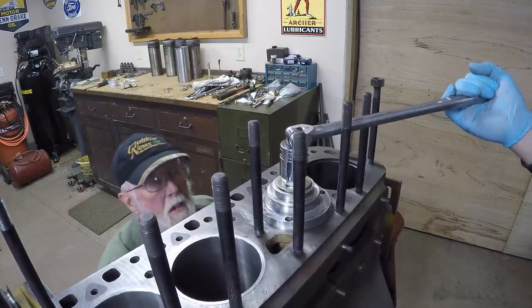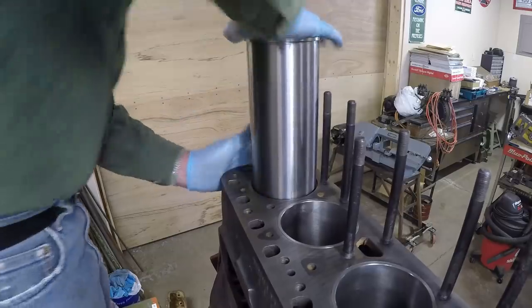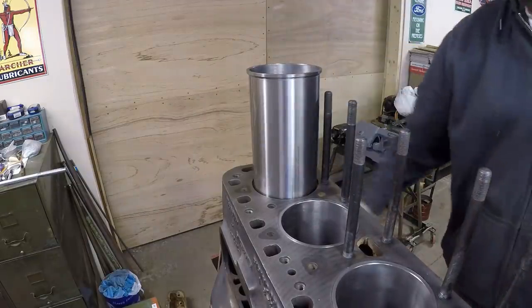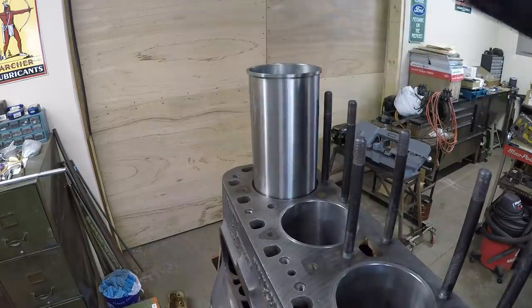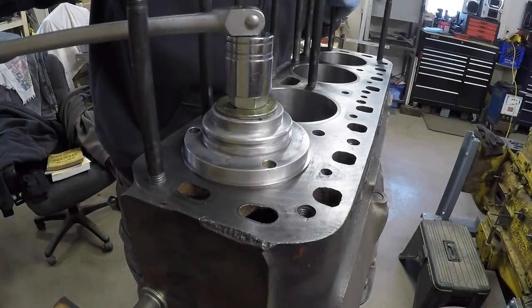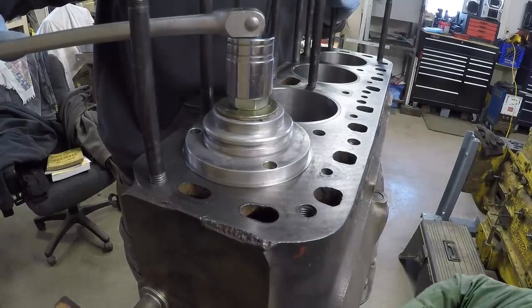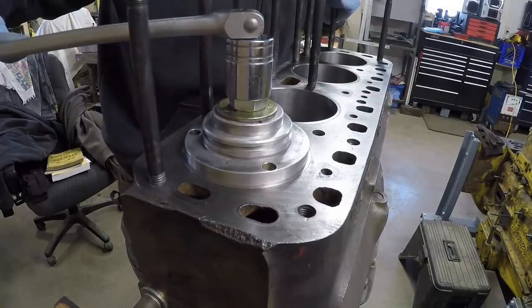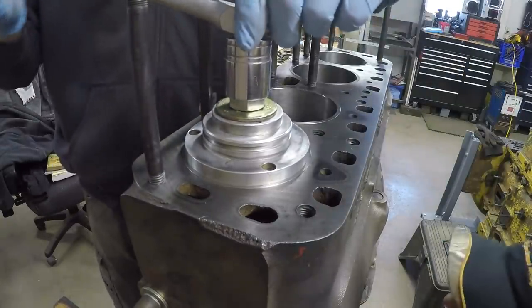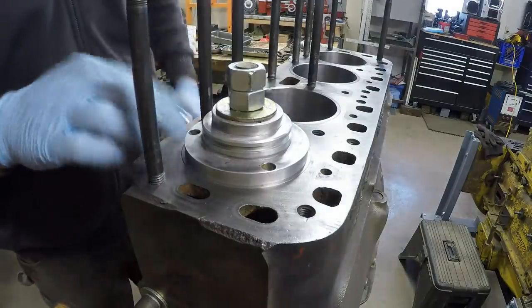I think you're down now — all right, just going to seat number four by hand. We probably won't do the time-lapse of this one because we're so close to the frame of the engine stand that we'll have to do three-quarters of a turn and then reset. It's drawn into the counter bore now — we're almost there. I think you're there — yep. We still prefer to torque down on the bottom because if we spun on the top it would impart rotation into everything else, but all in all it looks like it worked out pretty well.